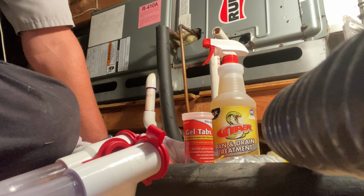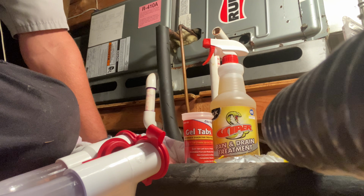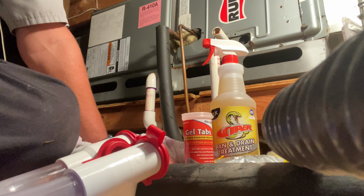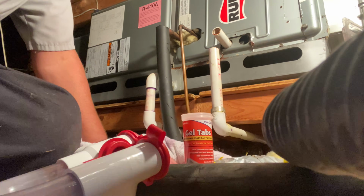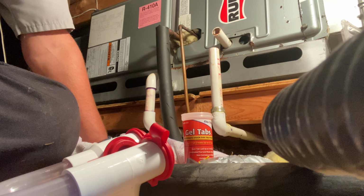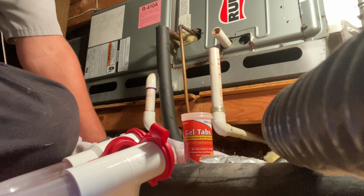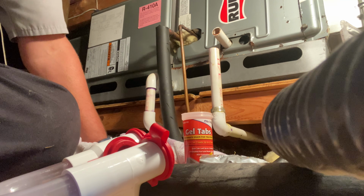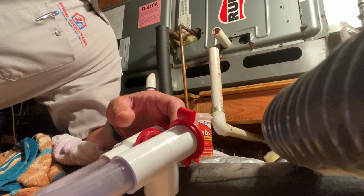All right, can you hear me? Let's talk about some options here. So we have the drain, which you wrapped some duct tape and yellow tape around. This rubber thing, which failed. But I had mentioned before that there's no trap on this. A trap is essentially a U-shaped pipe, looks like this, and it's required.